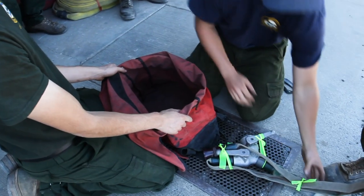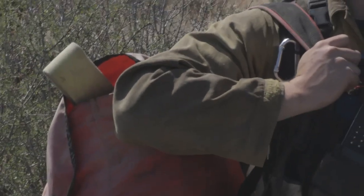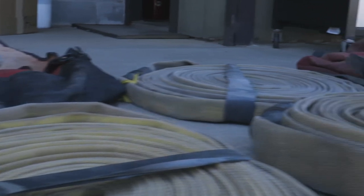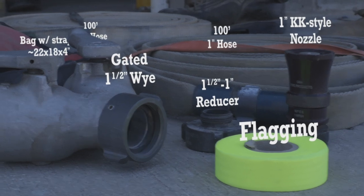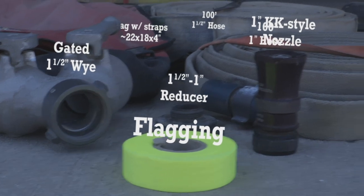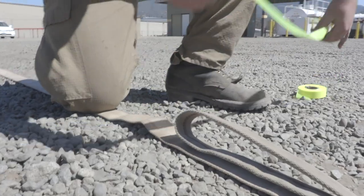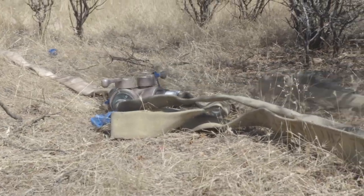To begin with, you'll need a good hose pack. The Grants Pass Unit likes hose packs that are 22 x 18 x 4 inches in dimension — big enough to hold everything, and the straps make it easy to carry a couple of bags at a time. You will also need one 100-foot length of inch-and-a-half hose. It can be done with 200 feet, but you'll definitely need to use a hand primer to pull out all the air before it will fit in the bag. Also needed: one 100-foot length of one-inch hose, one inch-and-a-half gated Y, one inch-and-a-half to one-inch reducer, one nozzle — we use the lightweight KK nozzles — and a roll of flagging tape. Do not use escape route or other danger flagging tape, as this can lead to confusion of escape routes and other firefighting operations when the flagging is on the ground after deployment of the pack.